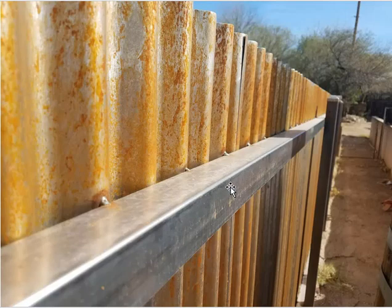This is 1x1 stock. Those are 2x2 vertical posts in the ground, and they had larger posts on the end and around gates, and they tack weld it to the corrugated metal. This is typically lower gauge metal. The corrugated metal is kind of more floppy, you know, and they run two horizontal brace bars and then just butt weld it, and then just run it right down the outside proud of the post.